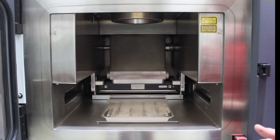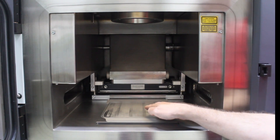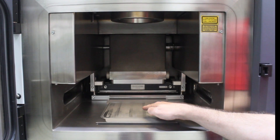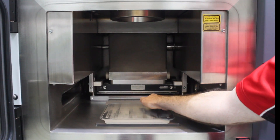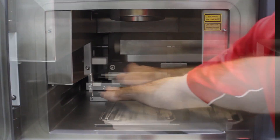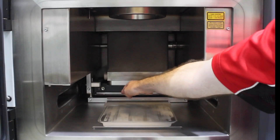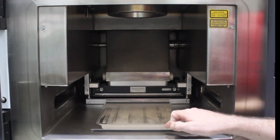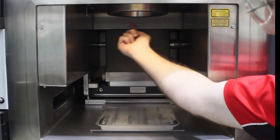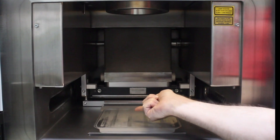So how exactly does 3D printing of metals work? The key features of a metal 3D printer: first is the build plate, which is usually in the same material as we're building. We have a silicone rubber wiper blade at the bottom, and a series of holes at the bottom of the hopper so you can meter new powder into the build. The wiper blade wipes it across, and any excess falls down this slot. Up here, the most important part is a 200 watt laser which shines down onto the material.